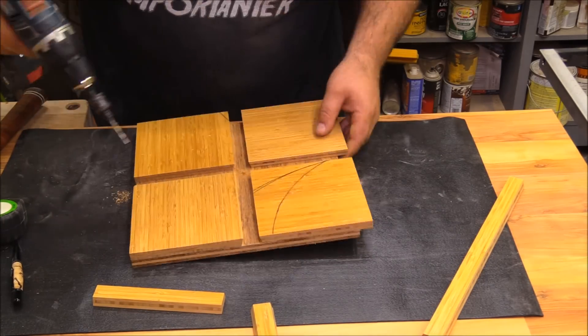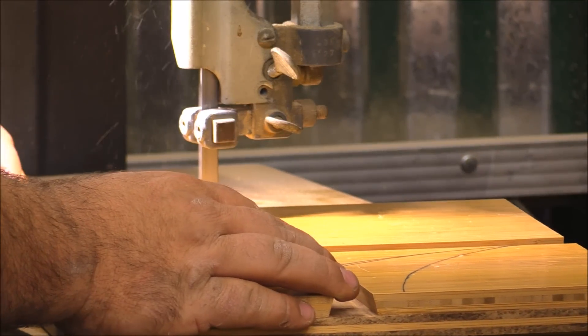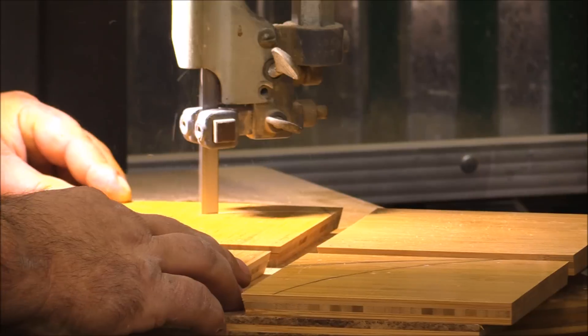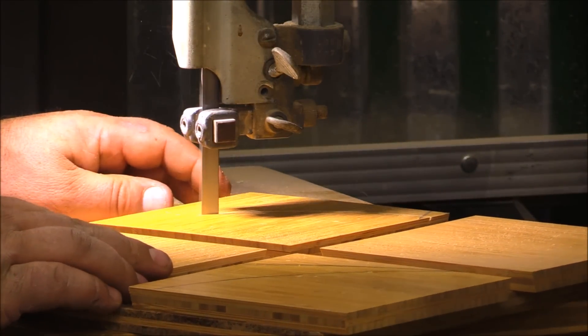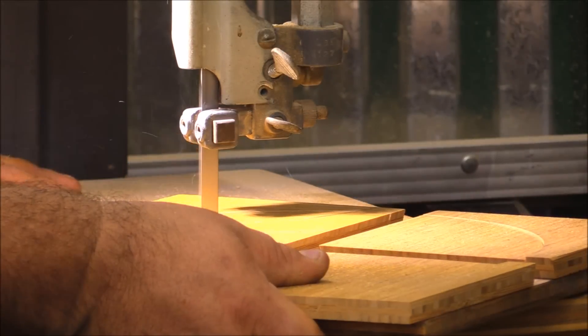At this point I'm going to drill a hole right in the center because I want this particular elliptical jig to be round. I took it over to the bandsaw, put a screw in the center position, and then pivoted it around the blade, which gave me a nice round base.